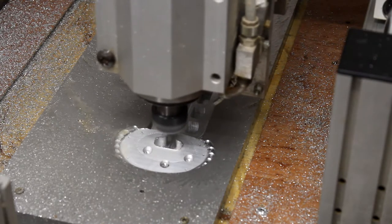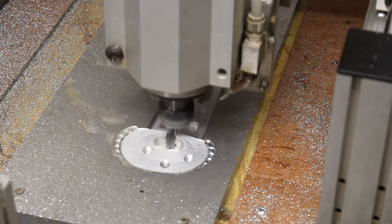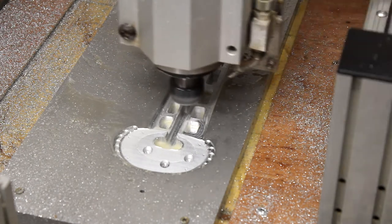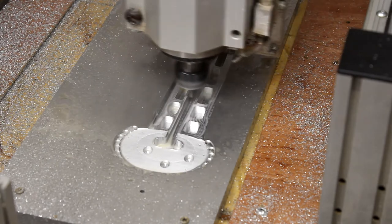As you can see, what the 4mm tool is also doing now is starting to clear up some of the lateral — or radial — material left on the toolpath from the previous 6mm cutter.